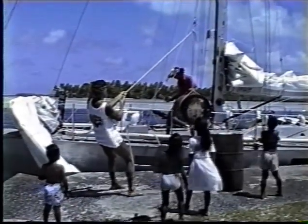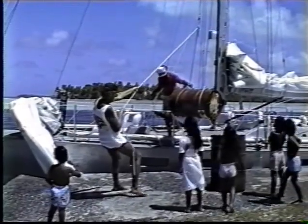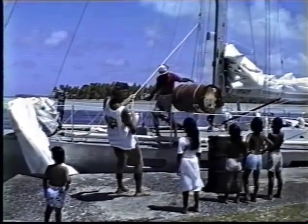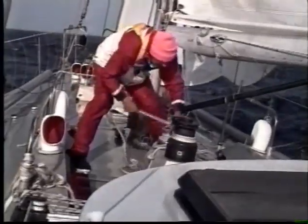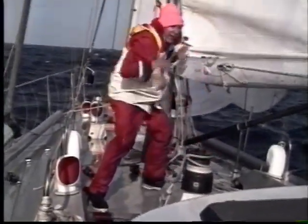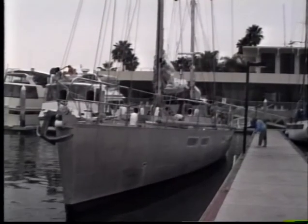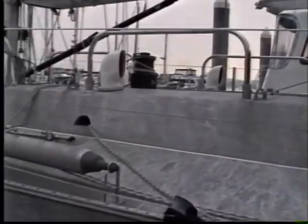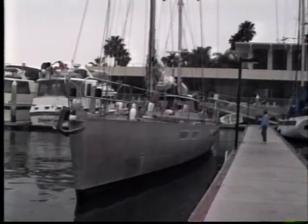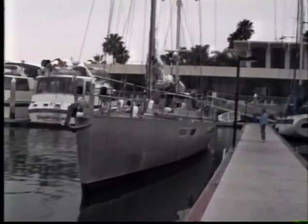A power winch has other applications too. Hoisting drums of fuel, going aloft, and retrieving the anchor are just a few of the uses. And for reefing, it can't be beat. We also use it to work the boat onto a dock when the wind or current is making things difficult. A breast line is rigged through an eye amidships. Once this line is on a cleat, Sundeer is under control.